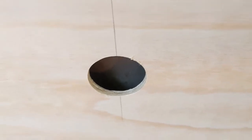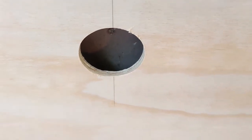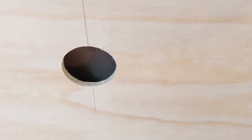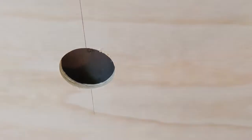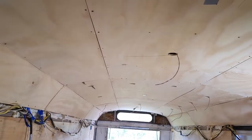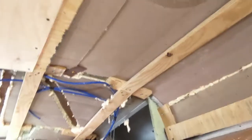Right here is the first hole where I'll have to fish for the wire — I don't think I can get the camera up in there. I do have a scope for this so I should be able to figure out where the wire is, but I don't have it with me. I'm making good progress — most of the wires I've found, a few I've got to fish, and over there I accidentally cut a conduit with the hole saw, so I'll have to join two halves of a tube together. I've drilled all the lighting holes in the ceiling I can do so far, with three more to do in the front section.